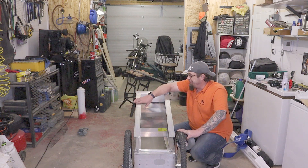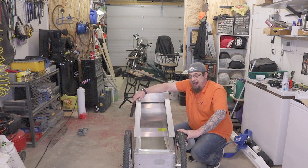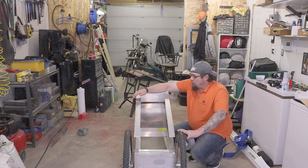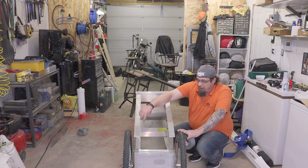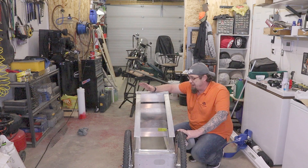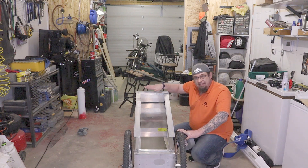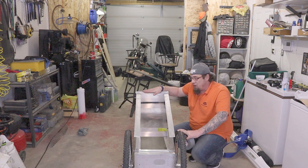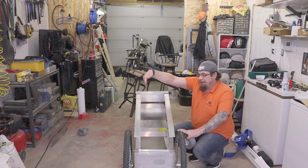So we need to figure out how to get water, and what we're going to do today is build that from scratch. I have a two-inch pump that I'm going to reduce down to an inch and a half, so I need to build an inch-and-a-half spray bar. I'm going to build a U-shape, which is standard. Some guys build it with the bottom down, others build it with the bottom up. I'm going to build the bottom of my U here so I can have everything attached to the main support, then come down on each side spraying in.